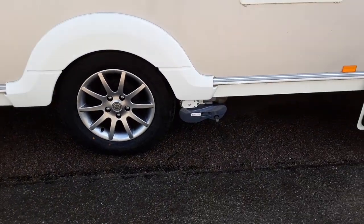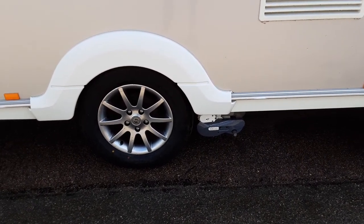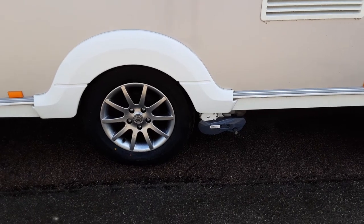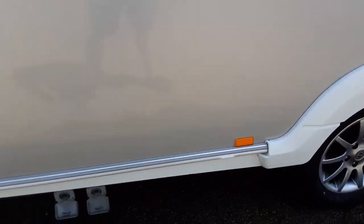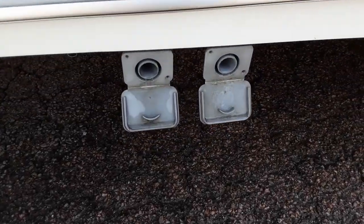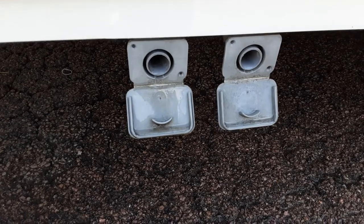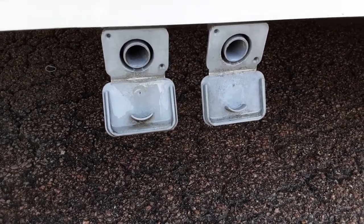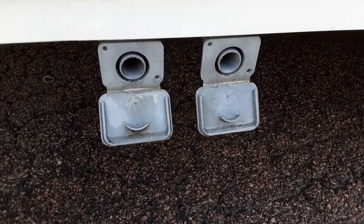The motor mover is a Power Touch Evolution auto engage, which we'll demonstrate at the end. We'll also check the wheel nuts prior to taking the caravan from site so you can see they've been tightened correctly. The fresh water that goes in at the front has to come out somewhere — those two grey pipes go into the larger diameter holes and drop down inside the waste master, which will be part of your start-up pack.